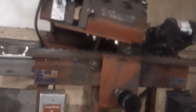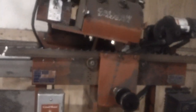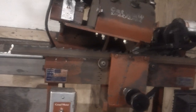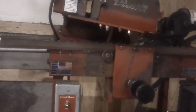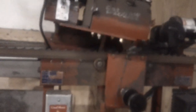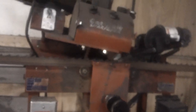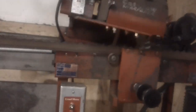I have taken blades and resharpened them as many as eight to fifteen times. I'll sharpen them down until the height of the blade is three quarters of an inch, and at three quarters of an inch I don't run them on a sawmill anymore — I'll cut them to length and use them on a vertical inside bandsaw. You're better off to do two to three light sharpenings on a blade than one heavy sharpening.